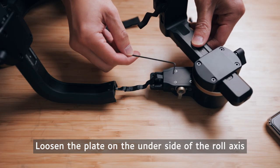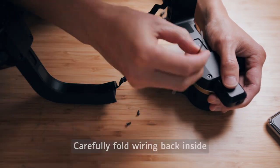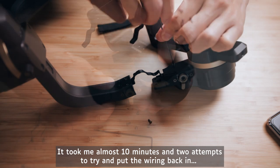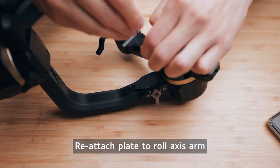What you have to do is loosen the tiny plate on the underside of the roll arm — the part closer to the tilt arm — and then carefully put the wiring inside, then close it up again. It's a hassle, but make sure you go slow to avoid pinching or damaging the wiring. The whole process of taking the arm off is more involved than I would have liked. I wish they had a simple latch or locking mechanism that's much easier than this whole process.